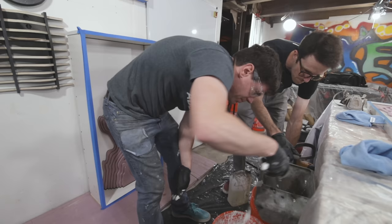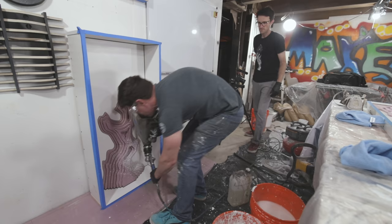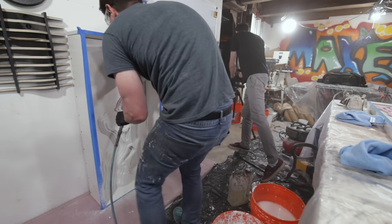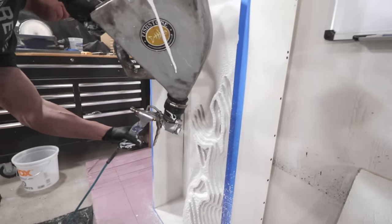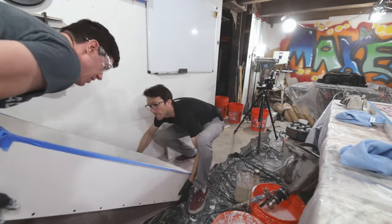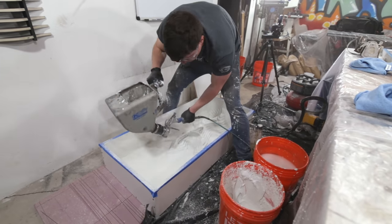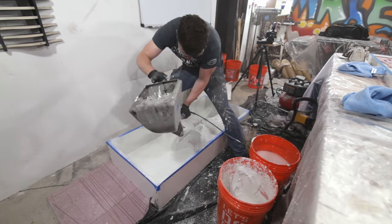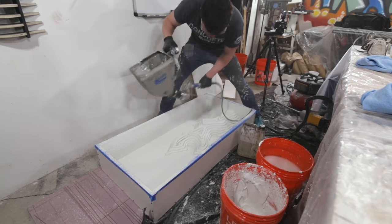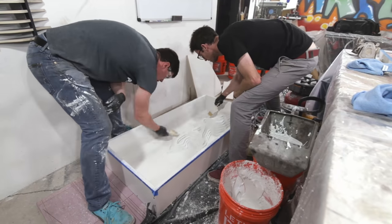I then loaded up my hopper spray gun to spray the thin beauty coat. I started by spraying with the form oriented vertically so that it was easier to coat the tiered foam knockout. We then placed the form horizontally on the ground so I could more easily spray the rest of the form. Some of the professional concrete folks on Instagram advised me to spray in a U-pattern pointing towards the portion of the form already covered in concrete, to avoid sand particles getting on the unsprayed surface. I'll leave links to those Instagram accounts in the description - you should definitely check them out for more concrete inspiration and knowledge. After spraying, we brushed the face coat with a chip brush just to be sure there were no trapped air bubbles.